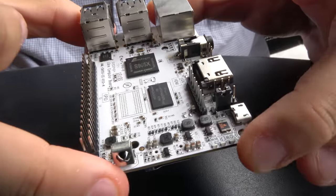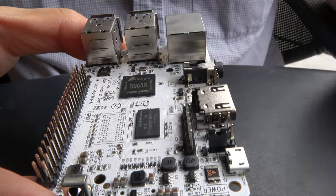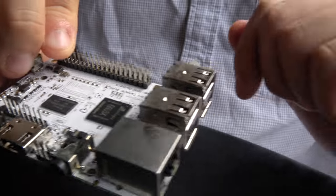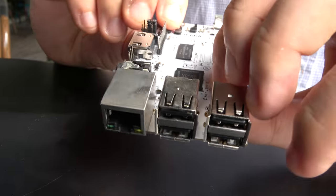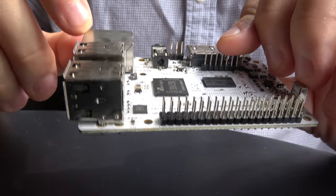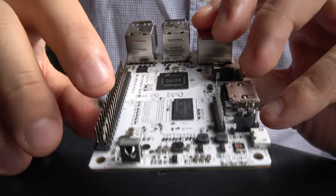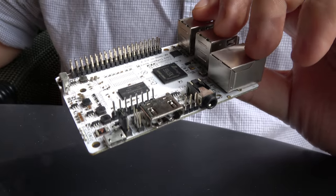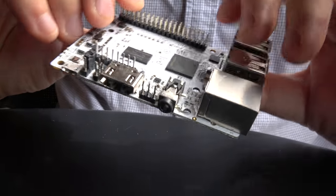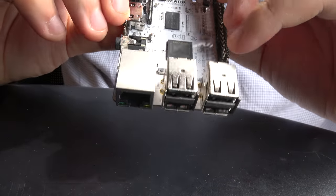In terms of what we upstreamed — device trees and various drivers for HDMI, USB, and Ethernet. There are also community members who provided support for various drivers on this SoC, including the Ethernet PHY, USB OTG, all the GPIO, SPI, and all the functionality on the board that previously wasn't exposed. Vendors usually have a BSP based on a really old version of Linux, which isn't suitable for applications today where security is sensitive.